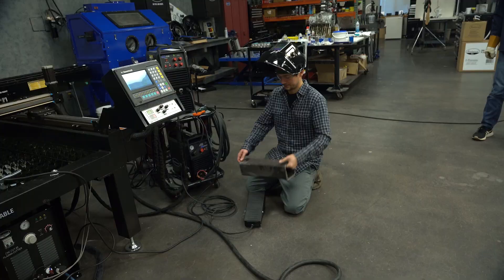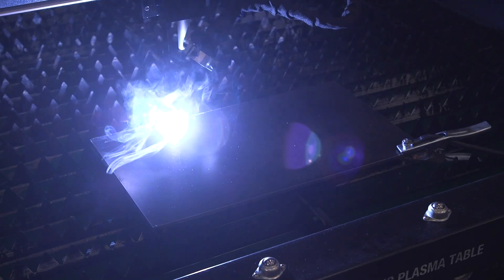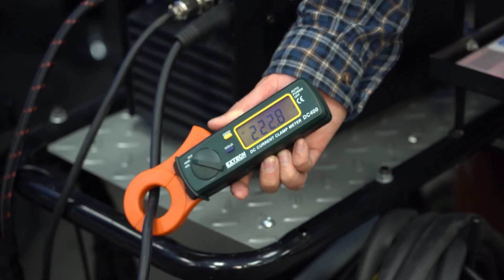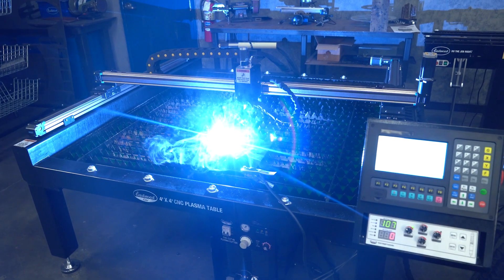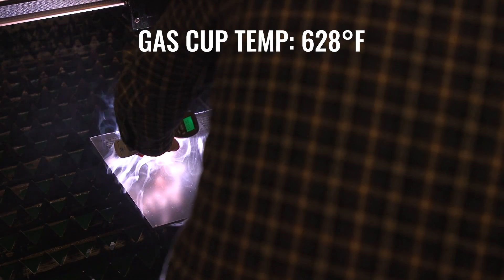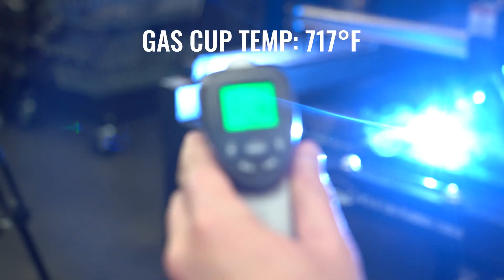We are going to need a little cruise control. We're going to kick it off. So here's something worth noting — it's a 200-amp TIG welder and we're always conservative in our ratings. Definitely getting warm. We just took some temps on the gun: 628 degrees at the gas cup. That thing is getting hot. Hopefully we see some carnage here pretty soon. Ooh, 717 degrees.